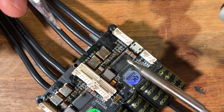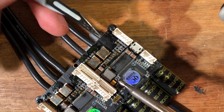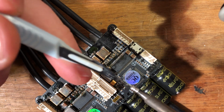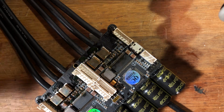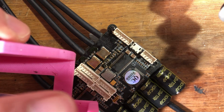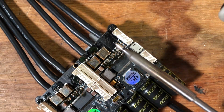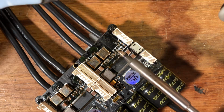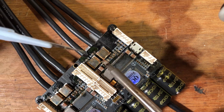What that means is that the resistor is basically stuck to the pad properly. So what I'm doing next is, because I'm talking so much, you can see that the tin on the soldering iron is starting to become dull and gray, and that is because I'm burning off all the flux. So basically cleaning the tip, retinning it, and I'm trying to get sort of a big pillar on the bottom side of the soldering iron, so I can just push it on top, and the solder itself will conform around the resistor.